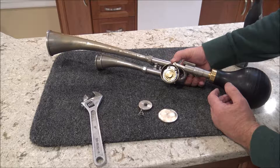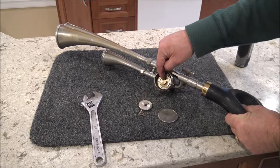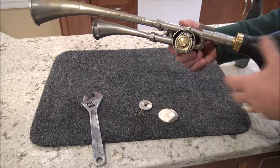There's also this little lever here. As you can see, it moves back and forth and it advances the inner drum. So as you push the horn bulb in, it advances the arm and the cylinder on the inside to one of the slots, redirecting air to one of the four horns. As you withdraw, the suction of the horn bulb pulls the arm back and resets the cylinder drum.